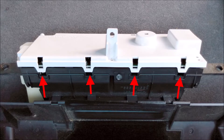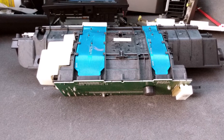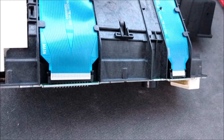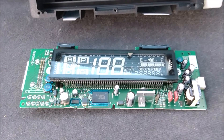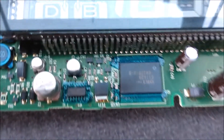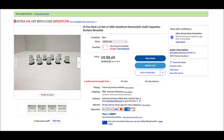The goal is to get the circuit board out of the instrument panel so we can replace that capacitor. To do that, we need to remove this plastic cover piece — it has four Phillips screws — and release all the locking tabs around the outside. Here is our circuit board. Before we remove it, we need to detach a couple of ribbon cables. Carefully pry out the locking tabs on the ends of the electrical plugs, then pull the ribbons out. There's also one more electrical connection to remove. With the circuit board removed, we can get a good look at that capacitor we're going to replace. It's this little silver one — the number 100 printed on top indicates it's a 100 microfarad capacitor. The ones I bought are 220 microfarad, based on recommendations from people who know more about electronics than I do.